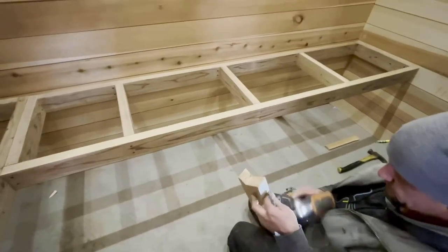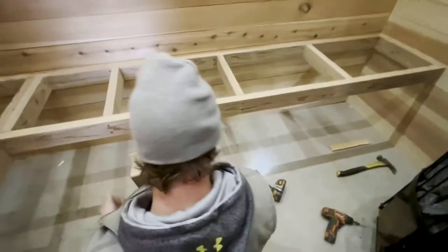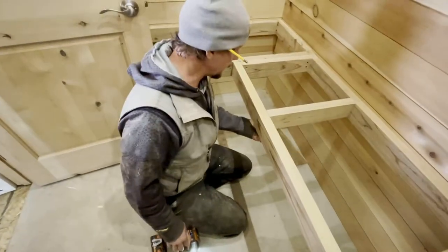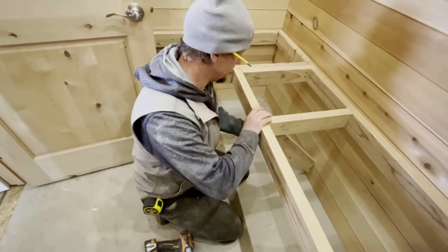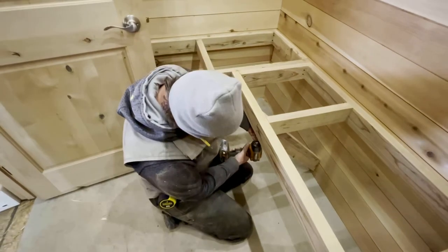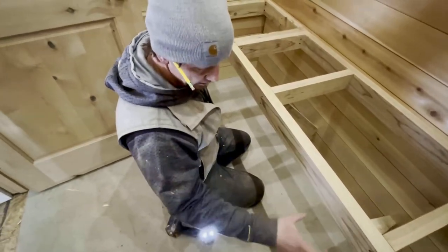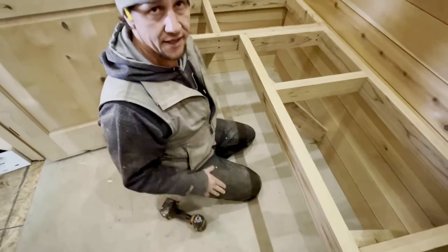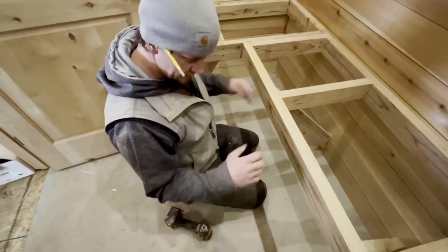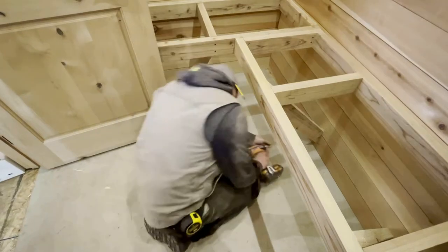I like the idea of the seats not having any floor legs. I like the way you always do that. You've always done our pantries like that. Nothing worse than having something clear down here and you just can't get under it to get it clean. It just bugs me. I've hated it in shops that I've run. It's nice when you can get all the way access to the wall. If you had a leg over here sitting on the ground, that's a collection point for moisture between the wood and the concrete. It'll just rot at the bottom and then it'll be no good as a brace because now it'll have a gap. Then everything starts sagging. So we pull it back here. The moisture stays off of it and keeps its integrity.